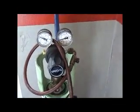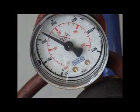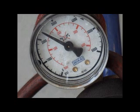If you look at the regulator, you can see the pressure here — 2,300 psi. Certainly not the thing to start playing around with in the workshop. If you ever get a regulator, fit it to the bottle first, then check the pressure. Do not remove the plastic cap from the bottle, put your hand in front of it and just see if there's any pressure in the bottle — it will cause serious damage. So connect the regulator first.